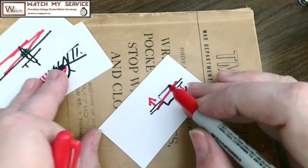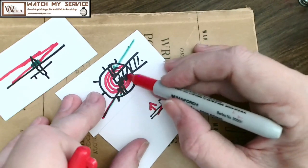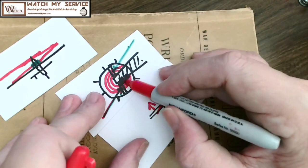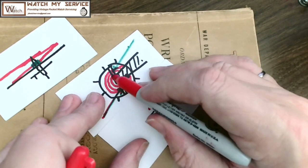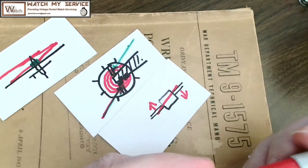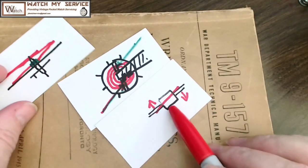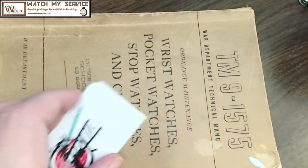And so when the hairspring went around from its pinned and studded position on the balance bridge and went around through the regulator pins, it was already at an angle pushing it downward, and it pushed it downward to the point where it was touching the arm of the balance. So that was something that I had to fix at the stud here. So hairsprings can be a mess.